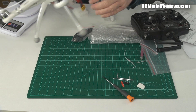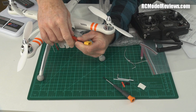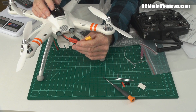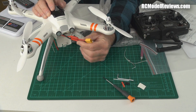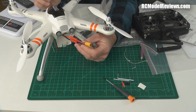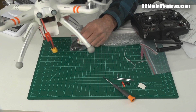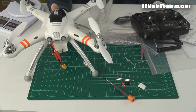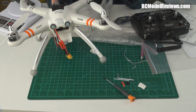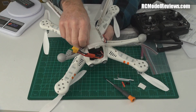In the battery compartment, they've used one of those horrible little connectors I can barely get apart. I've bought an XT60 converter, but I'll probably just chop it off and solder an XT60 directly — I don't want extra weight and bulk doing nothing. It takes a 2200mAh LiPo; I've got some 2200 3-cell packs and a Zippy 2450 compact to try both out.